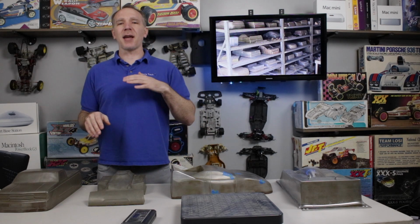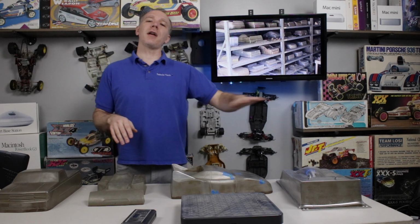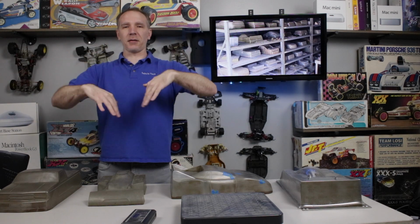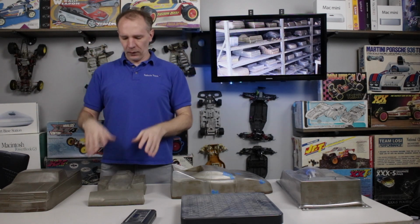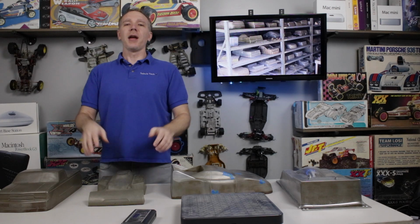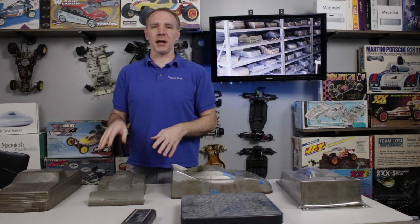But the plastic actually comes as a sheet to them with the artwork already on it, and then they engage the vacuum and it sucks everything in. If you had the artwork on the inside like you normally do on something like this, it would stick to the form or buck. It would potentially damage that paint and everything on there.